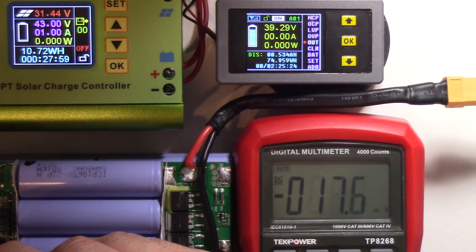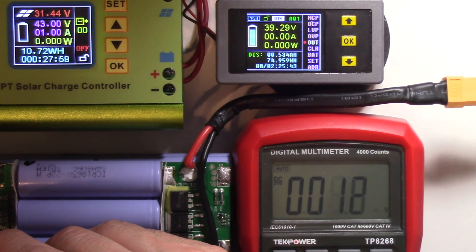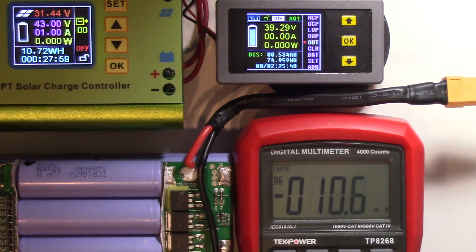We're talking hundredths of a volt difference. And 4.21 — that is the cell that was overcharged by 0.2 volts — is just bouncing between 4.20 and 4.21. I'd say that's perfect. Overcharge protection is working fine. The last cell reads 3.96, so all the other cells are exactly where they should be, and the overcharged cell is at 4.20 — that's where the whole pack stopped taking a charge.